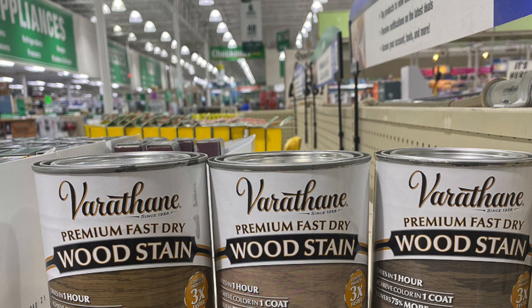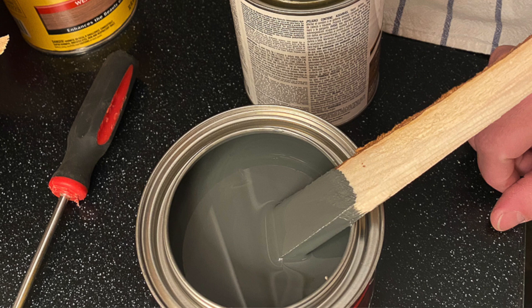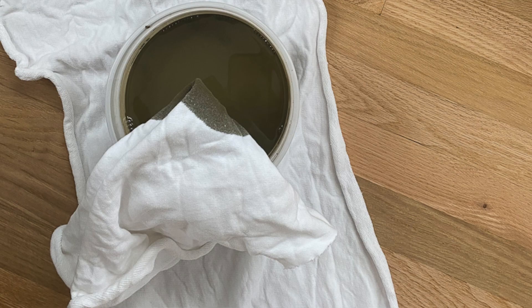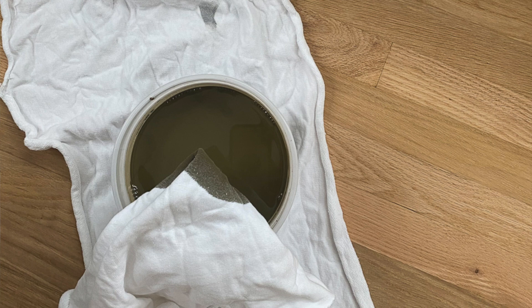We were in Menards here in Michigan and we found a Varathane stain called Aged Wheat, and right when I saw it I thought it looked a little bit green. It had these green undertones, and when we opened it up that night it looked straight green in the can. But when we put it on our floors it was very dark and I didn't want to go that dark. Another tip the Sherwin-Williams specialist told us is that you can lighten a stain by mixing it with mineral spirits — 100% mineral spirits. We did 50-50 Aged Wheat with mineral spirits and it was perfect.